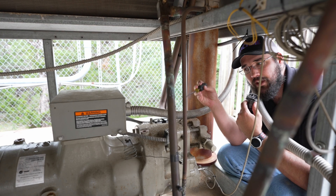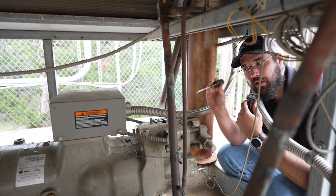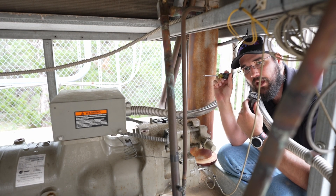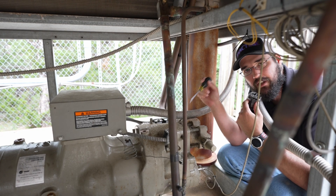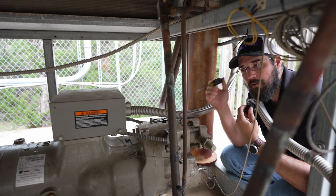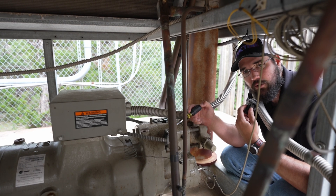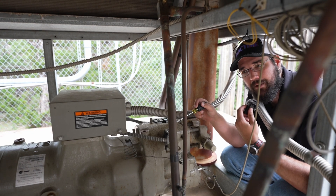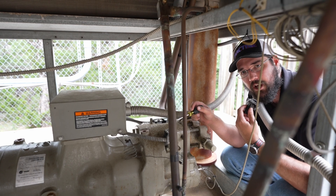After the compressor had failed once and then tried to turn back on without being able to pump the evap down, it was able to grab the load and refrigerant and keep going. What it also told me is that whatever was happening was because the evaporator was able to pump down — and when it's not pumped down, because it tripped on safety the last time it tried to run, that's when it was able to over-pull on the circuit. My next thought process was: something at startup is happening. That's when I got to thinking the female unloader is really critical at startup to make sure we're not overstaging the compressor and that the valve has a chance of keeping up. We were actually pulling down way lower than I would have expected at startup on the suction.